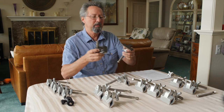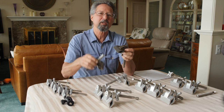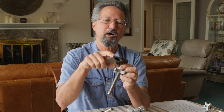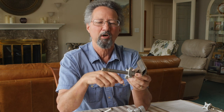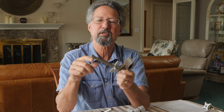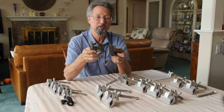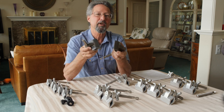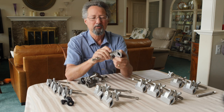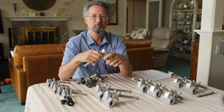I started out making two prototypes out of steel. I was taking machine shop classes at the local community college, so I machined these parts, went to a job shop and had the jaws bent, welded it all together, put it on a piece of 5/8 Acme all-thread that I altered into a semi-baby pin and gave them a try. They worked well enough for me to invest in molds to make the jaws out of aluminum and the knobs out of aluminum.